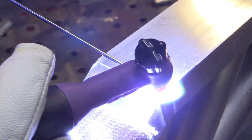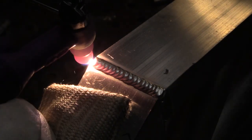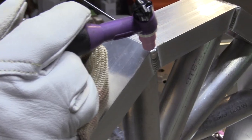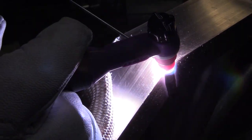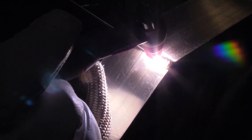I'm using a Dynasty 280 on this with the water-cooled Weld-Tek SW 320 torch — 320 amp rated but still really small, and it's working great. I'm using the pro settings on the Dynasty: 75% cleaning and 120 Hz frequency, and I'm still getting a pretty clean puddle even with a small cup. In a part two video I'll weld the cluster joints inside the cope tube-type joints, doing some different stuff and probably with a different machine.